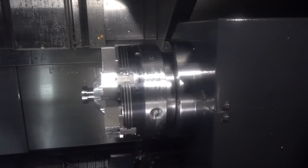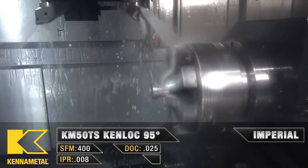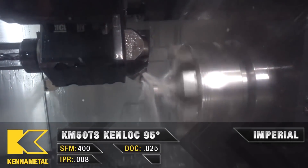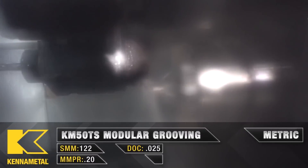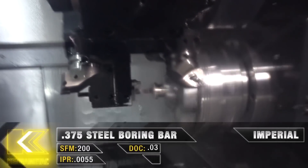I started running fast, and people would say my quality was going to suffer. But I started, like an artist doing oil paintings, getting into the material and thinking about every side, every little radius — even if it's not called out. Let's put a 3 or 5 thou radius right there. Let's speed up here, slow down there. I started really thinking about where I could speed up, where I should slow down — rough fast, then when finishing the part, slow it down, baby it, take the pressure off.